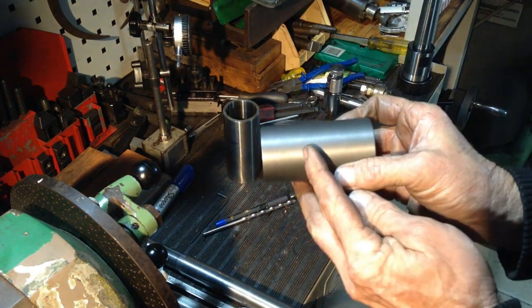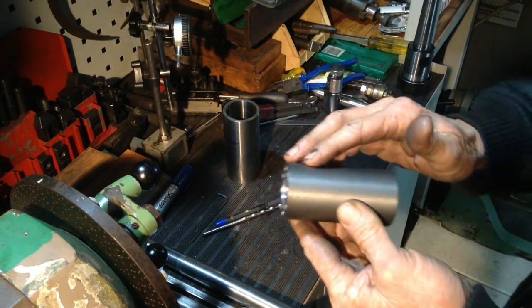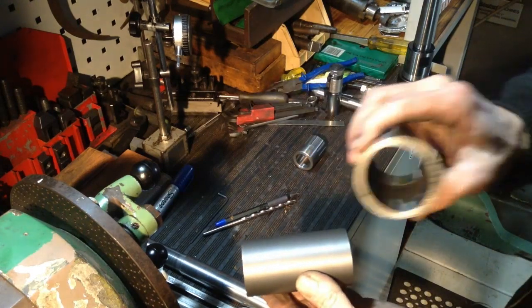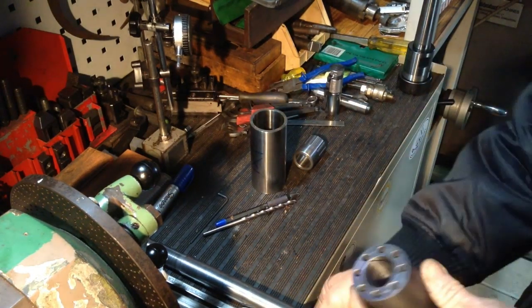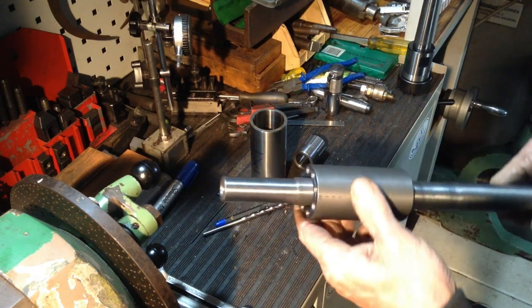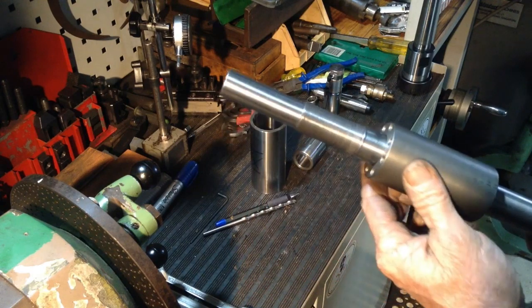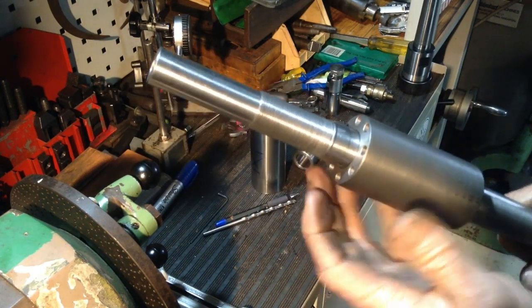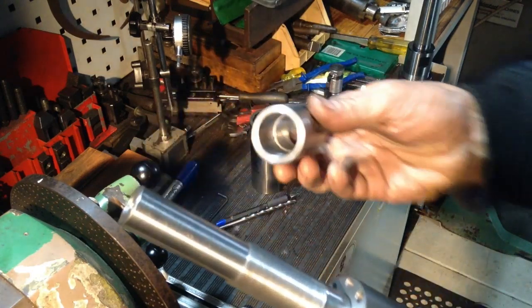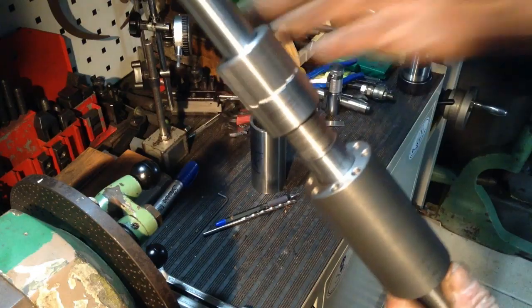So we'll get this in the lathe and get it parted off. Well, before we part it off, we'll take this to the finished diameter that we need to lap to, an inch and 7/8, and then we'll part this in half. And then it goes that way. Because we have chopped a fair bit off it, it's come right up on our taper now. But luckily, we had a fair bit of relief cut inside our nut.